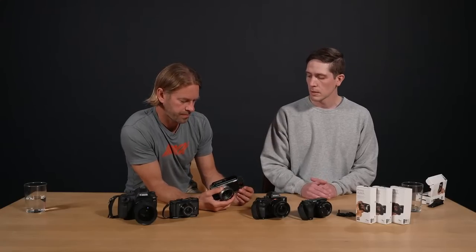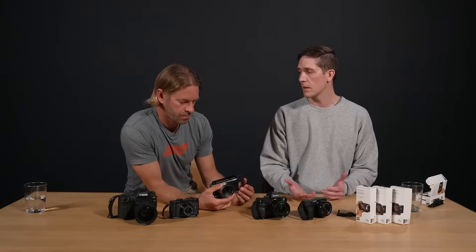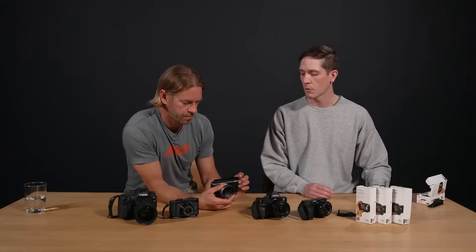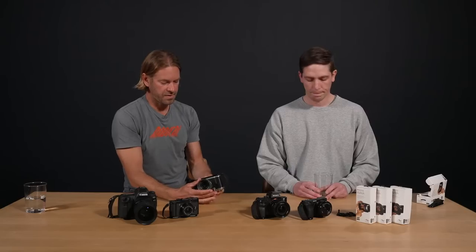For most stainless steel fasteners or stainless steel components for Peak Design products, we use a pretty expensive and fairly durable PVD coating. We don't use black oxide. We've phased black oxide out of most of our fasteners due to environmental concerns and corrosion issues. Right on, same PVD coating on this fastener as well. Okay, cool. Thanks, Dave.